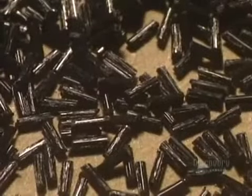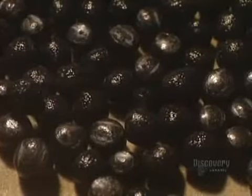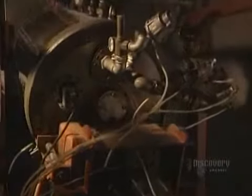Now they're going to fabricate the foam interior that will be placed inside the shell. It's made of polystyrene beads that will expand and bond together. This expander increases the volume of the granules that fall into it. Steam and an agitator let the polystyrene beads expand uniformly. The granules are now ready.